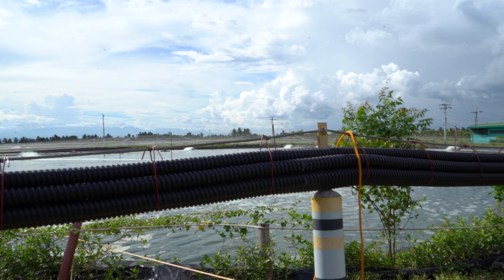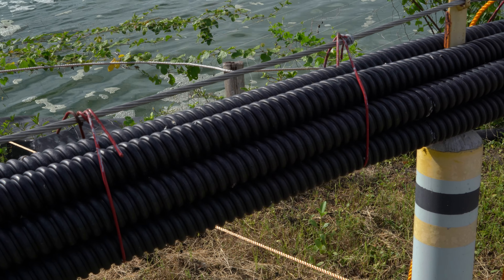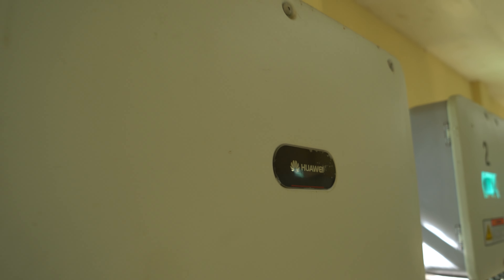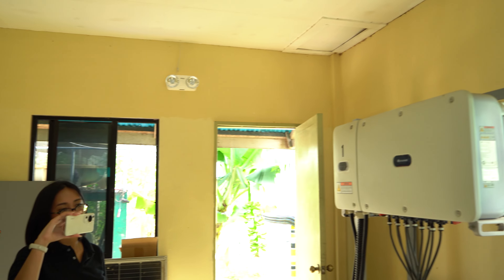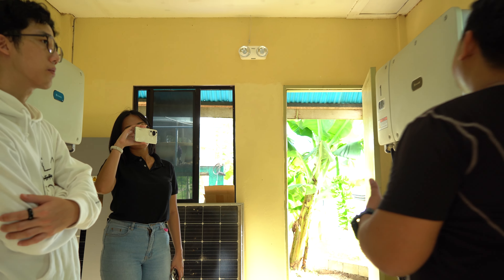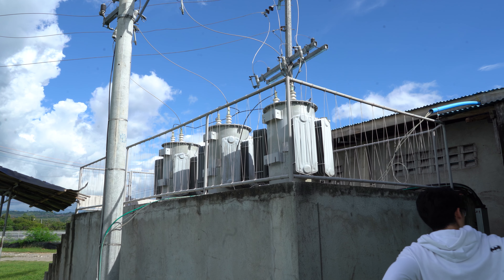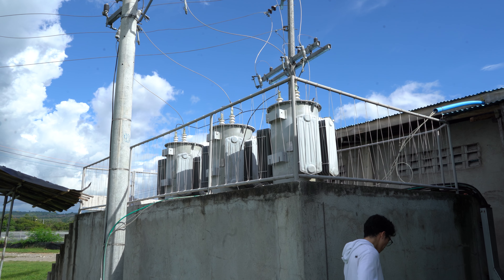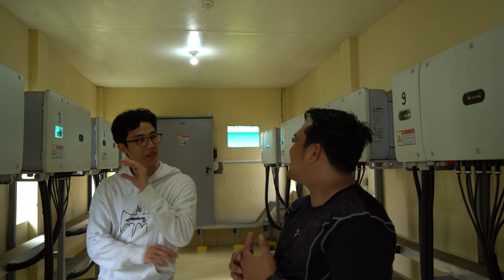The electricity produced by these solar panels goes through heavy-duty cables housed in conduits for weatherproofing, running all the way to these FusionSolar inverters supplied by Huawei. The setup here is an on-grid type system, meaning it doesn't have a battery to store energy. Instead, they use the grid from the utility provider to lessen or deduct the output from the eventual electricity bill at the end of each billing cycle. These Huawei FusionSolar inverters are touted for their high conversion efficiency and are already made for any type of solar energy setup.